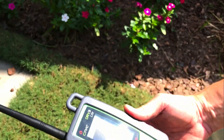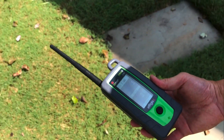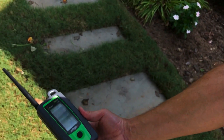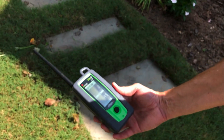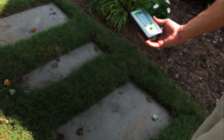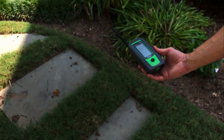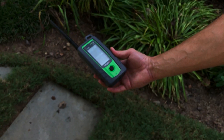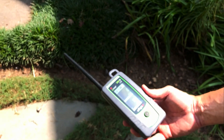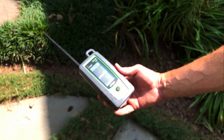Six, seven, eleven, nineteen, twenty-three. This shows that it is possible to find some sort of impairment in a buried drop. 53, 83, 88 microvolts. Now we're up to 160, 190, 180. Okay, so we just passed where the impairment is because now our leakage is dropping down, so I'm going to go back.